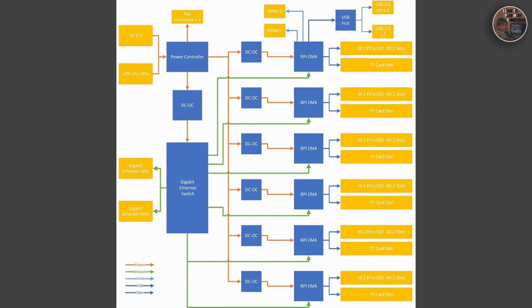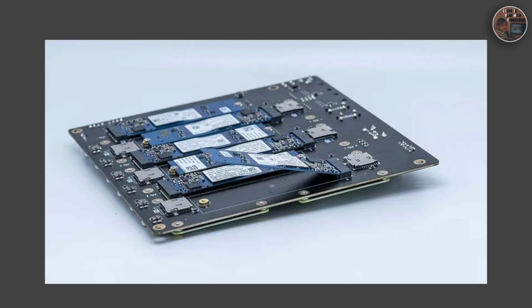The only shared ports are the Ethernet ports, which are directly wired to the internal 1 gigabit switch, as well as the DC-in power connector and the compute module activity LED matrix, which is a pretty helpful feature in order to identify bootloader issues, I can tell you. Each compute module is also connected to an SD card slot and a dedicated NVMe PCI Express port, which are both located on the bottom side of the DeskPi Super6C mini ITX board.